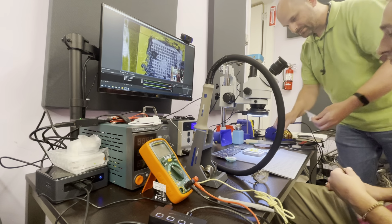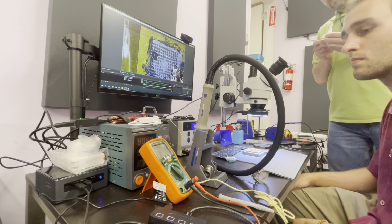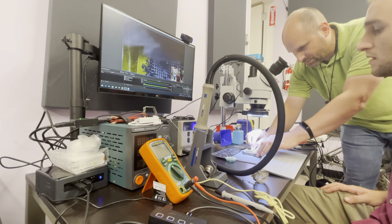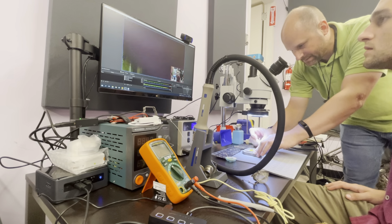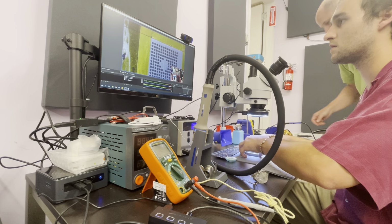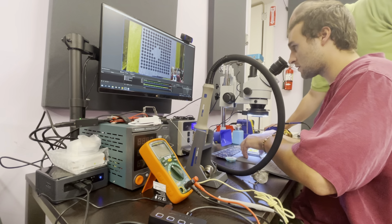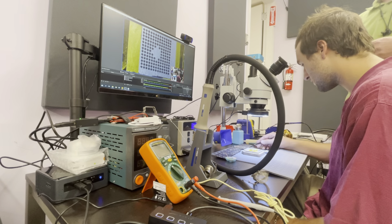And the other thing too, solder paste usually melts at a lower temperature than regular solder to make it easier to work with. But because of that, it has more flux and it's tiny little balls. If you zoom in really far on this, you'll see that it actually is balls. You're missing two. Yeah, tiny micro balls. And if you find that you don't like paste, you can also buy different size solder balls themselves.